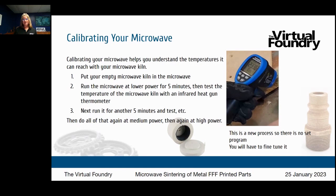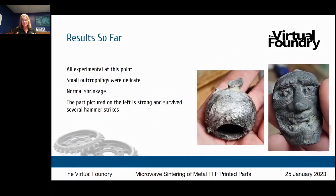This is a brand new process — there's no set program, so you'll have to put some time into figuring out what your equipment can do. Highball chose to start with aluminum, which is one of the more difficult materials to sinter because it's reactive in the presence of oxygen and heat, which complicates things — it requires a very special atmosphere, not something you can normally sinter in common kiln equipment like you can with copper, bronze, and steel. He went for the fullest challenge, and he's getting some really cool results that show a lot of promise, with a lot of failures along the way but some really cool successes as well.